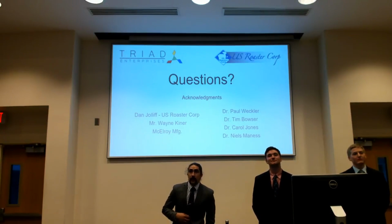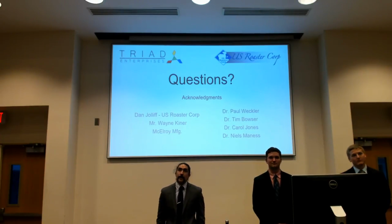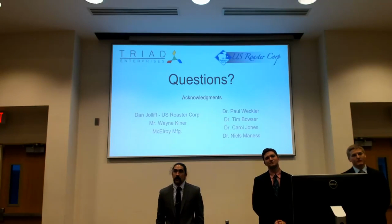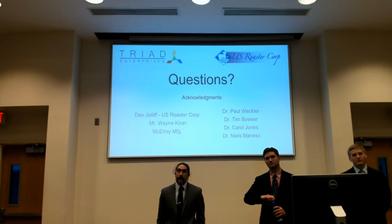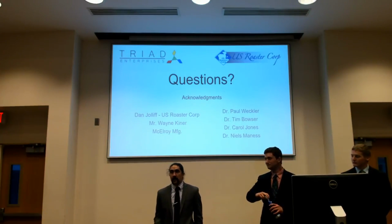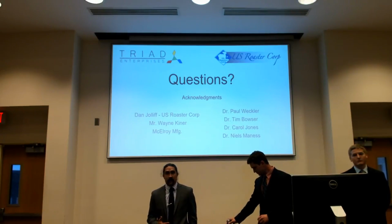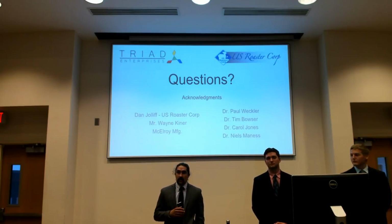Question, sir? Do both of your rollers run at the same RPM? Yes, sir. In the wheat industry, we make flour, and one roller runs faster than the other one. That strips the bran off the layer of wheat. I was curious whether, if you ran one roll faster than the other, it would roll that bean. We were exposed to very non-matched speed rollers when investigating some of the coffee bean grinders that inspired our roller design, but we never had the opportunity to test various speeds.